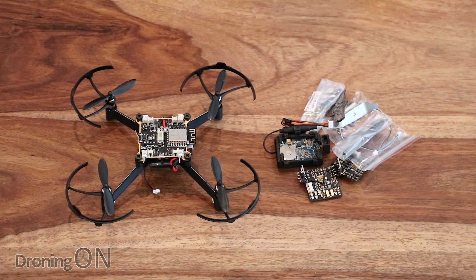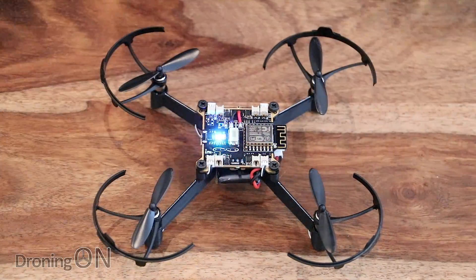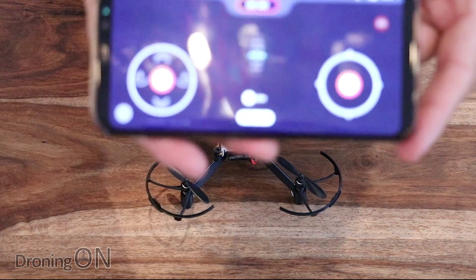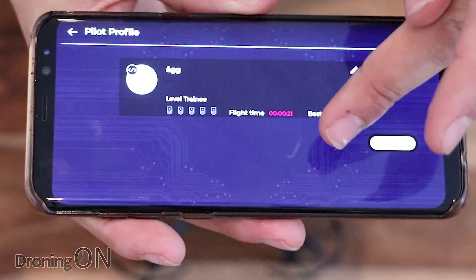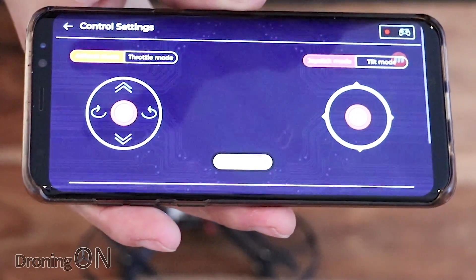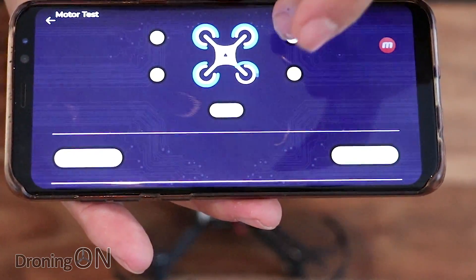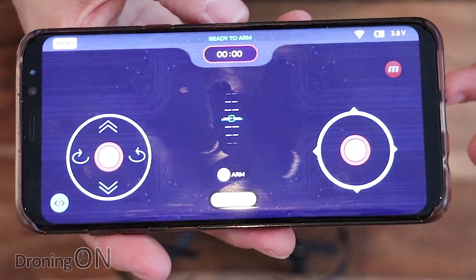Let's quickly power this up and have a look at it. There's a little power switch on the side — flick that and you can see the flight controller jumps into life and starts flashing. With the drone fired up, we've got the app that comes with it, and via this app you program the flight controller. There are loads of options under drone settings — magnetometer configuration, different pilots you can configure, control settings, various ways to control the drone, drone configuration, and you can even set the PIDs and test the motors. If you're used to configuring a drone via Betaflight, this will be very familiar.